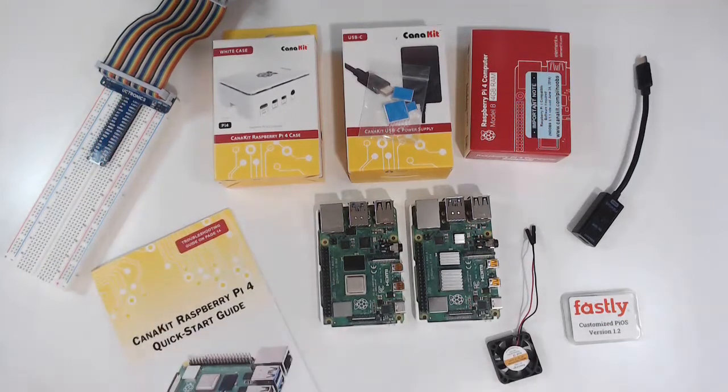But this would be a great time to pause the video. It's going to take you a few minutes to peel off that blue tape and position them. Two of the heat sinks are square. Really doesn't matter which way the fins are going on the heat sink. Of course, the one that's rectangular can only go in one location. So again, go ahead and pause the video, get those three heat sinks on, and then we'll continue on with the next steps.